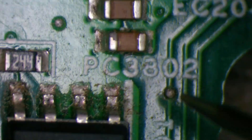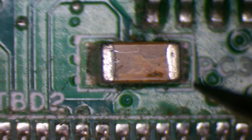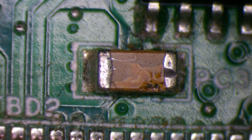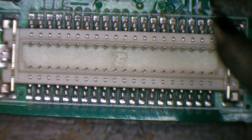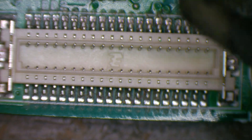There are two little ones down here but I don't think they're the issue, and some other stuff over there for the VGA port. This was a very common problem on this range of Dell where they had the separate board like this. We're working near a plastic connector — we don't want to melt it — so if we're going to use hot air we need a bit more range.